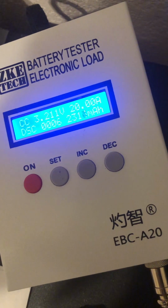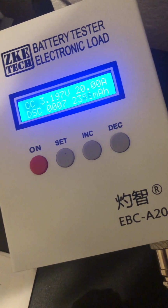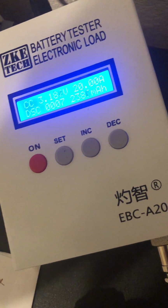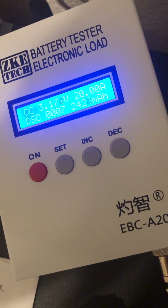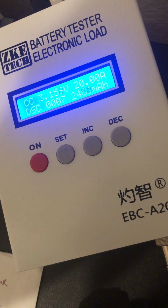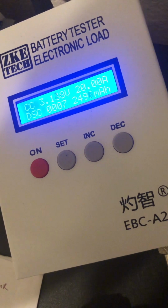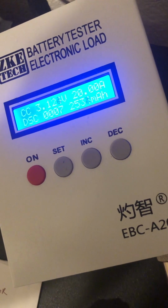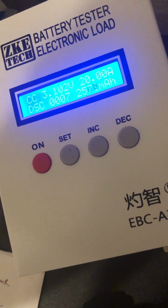So this is going to start going down even faster. Once you hit like 3.2, the voltage really starts to go. And once you hit 3 volts, there's not much under there. It'd be funny if we hit about the same capacity, because these things are really tight. They're all right at 3,000. And if you look at discharge curves too, you'll see that cells actually perform their best between about 35 and 40 Celsius. They'll put out even more capacity than they would at room temp, 25 Celsius, 20 Celsius, which is why they perform so poorly at colder temps.